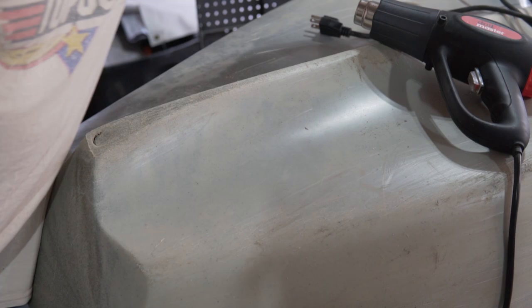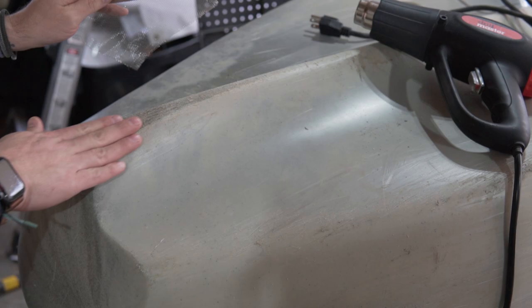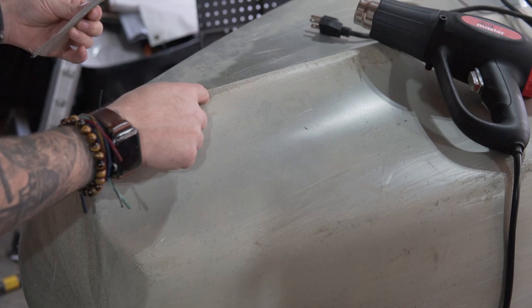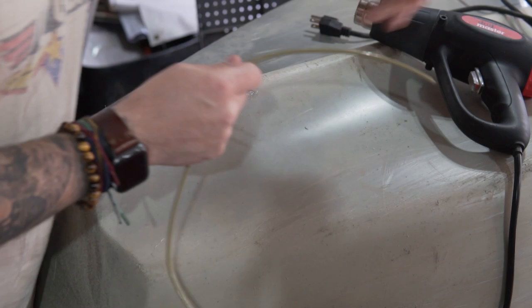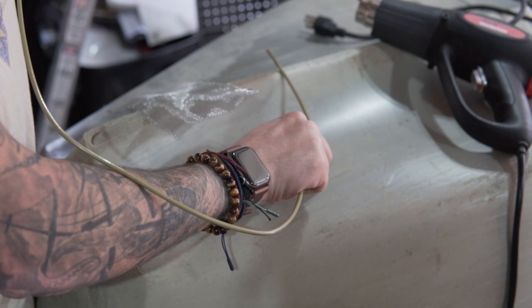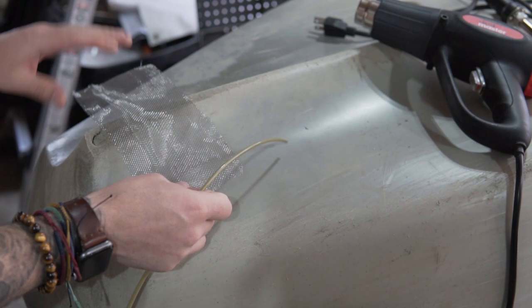Then we're going to start heating this up to see how thin this plastic really is, soften it up a little bit. And then we're going to put in some metal screen — some wire mesh — and push it down after it gets heated up, fitting it around this corner and doing a little bit of an oversized patch. Then I'm going to start building plastic with a plastic welder and a plastic rod that closely matches the color, feeding it through and melting plastic to build up layers on top of this mesh.